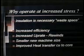Why would we want to operate at an increased stress? Well, while it's very hard for insulation people to acknowledge it, insulation in a hydro generator is actually just waste space. It's necessary, but it uses up the space that is required by active materials, and so that's part of the loss that is associated with the machine.